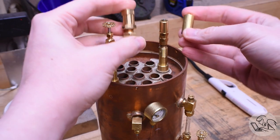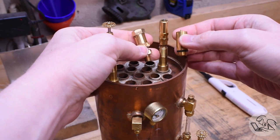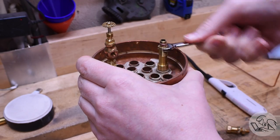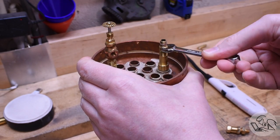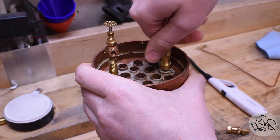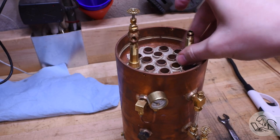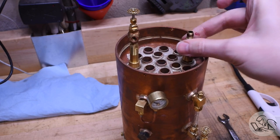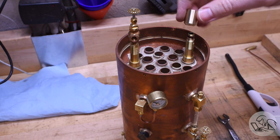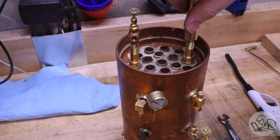I could try to turn the threads out of there or make a new cap, but I've put enough time into this experiment. Instead, I went and bought two commercial safety valves to try out. On the left is a Stuart Models safety valve from the UK, and on the right is an AccuCraft, an American company. Both are 60 psi from the factory, and the AccuCraft one is also adjustable, which is nice. I removed the standpipe, then put it right back on again, because I decided it's easier to just make a little adapter for now — I don't know which of these valves is going to work, and I don't want to make a new standpipe until I'm sure. So I made a janky little adapter for the Stuart valve and I'll give that a try first.